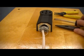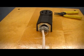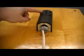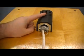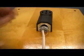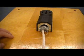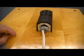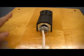We do not have a dryer to actually plug into this, so we're basically just going to take a multimeter and read voltage. You'll read each hot to ground, hot to neutral, hot to neutral, and then hot to hot. In here, hot to hot is going to read 208 volts. Everything else will read 120 volts.